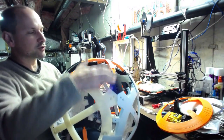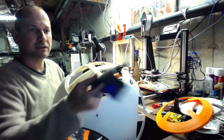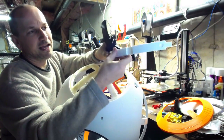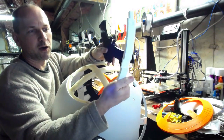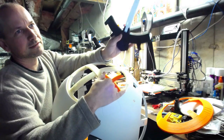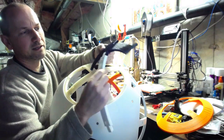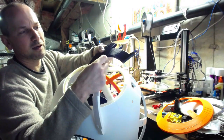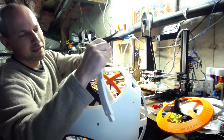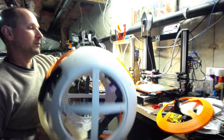It's really strong. You'll notice across the circle sections there's also a system of ribs, and there are two types: an under and an over. They go together with the segment, using the same hardware — the 4-40 bolts, inch-and-a-quarters, or M3 metric hardware. That all goes together and forms cross sections which support the panels.